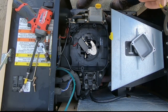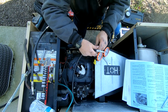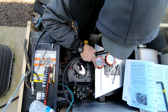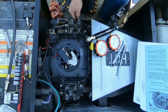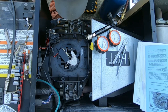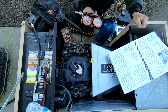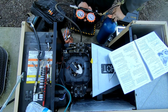I went ahead and adjusted the valves. Lock it in and see what it does — whether it moves the cylinder. See what happens if you're not perfectly at top dead center. It's leaking but not leaking below 20 percent. I like pushing down on it really tight to try to split the difference between going one direction and the other. So for the most part, our front cylinder has no leakage — front's perfect. The rear has a little leakage; the rings are leaking by a little bit but they're in tolerance.